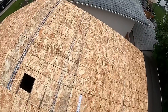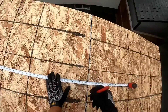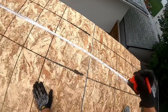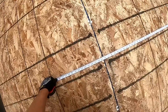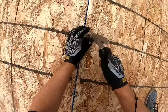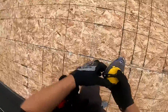That's 144 and a quarter, and I want to take off 48. So that's 90, and we're going to lap it by four, so I want to take off 52. 92? Nope, that's the wrong way — now I have to add eight, so 100. Because I want it to be more down, not more up. I want to take off 44 instead of 48, so yeah, 100. And then if I spin this around I should be about 44 to there — and I am. So that gives me a four-inch lap. What would be ideal is if I had a second person here to tell me when I'm exactly on this one with the chalk line, but we'll see what we can do.